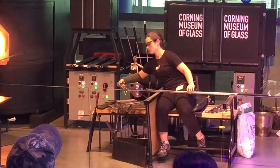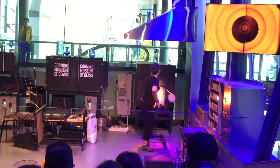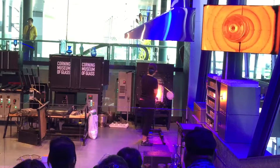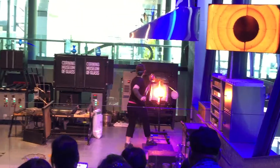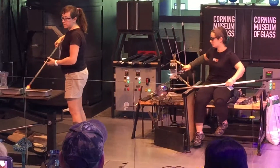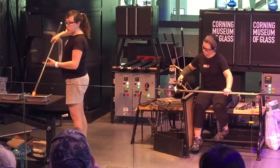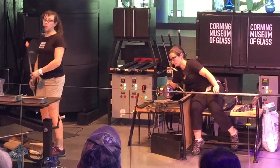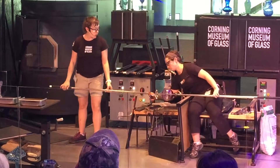The next step in the process is to flip this around — a process called a punty transfer. I'll help by gathering a small amount of clear glass on the end of a solid punty iron, shaping it very specifically — kind of like a pointy egg around the end of the iron. This will actually act as glue so we can temporarily flip this around while we work on the other section, meaning we open it up and finalize the form. The temperature this goes on is very crucial: if it's too hot it'll fuse too much; if it's too cold, this beautiful compote will fall on the ground.